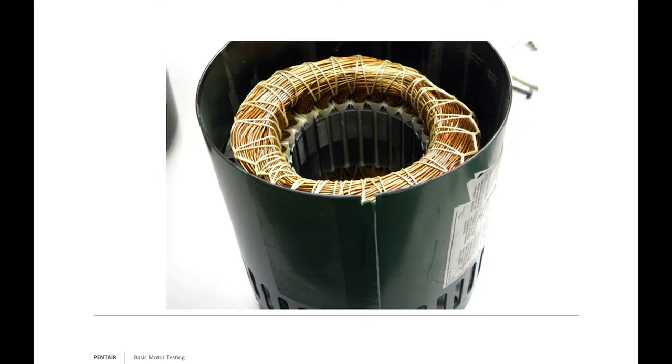I'm talking about above-ground pumps right now, though I'll also talk about submersibles—both share many characteristics. Submersibles are epoxy-coated so you can't open them up, but for an open drip-proof above-ground motor, I shine a light in and check: are the windings still that nice copper? Is the overspray complete, not bubbled or blistered? Are the strings still in place? And yes, I smell it. Anyone who's worked on motors will tell you: if you think the motor's been burnt, take a good whiff—you'll get that burnt ozone smell.